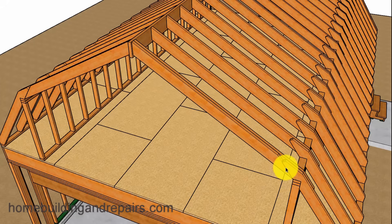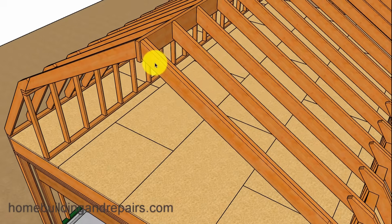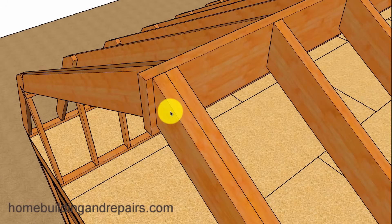Maybe somewhere around four or six nails to fasten those rafters together. Then you can end nail the rafters here or toenail them to the roof ridge. On this side of the building, I went ahead and lapped the rafters and installed another board here to create a flat surface for the wall framing. I also extended the roof ridge three quarters of an inch so that the breaks between the two pieces of fascia board will be nailing into the ridge.